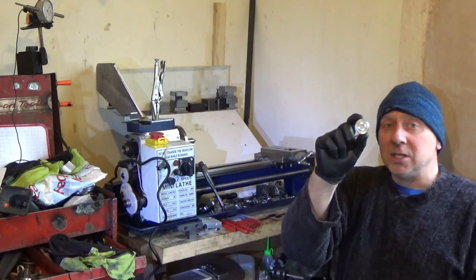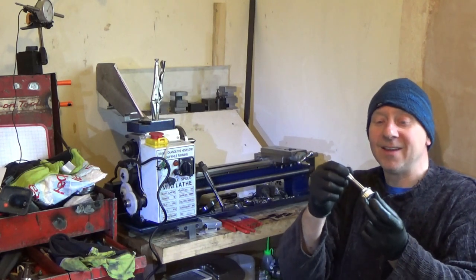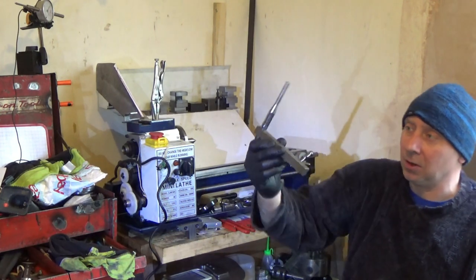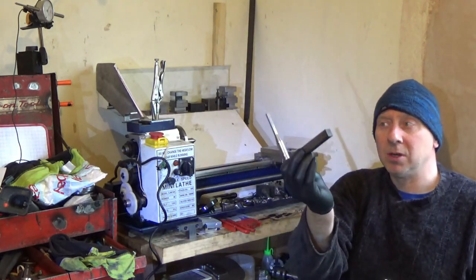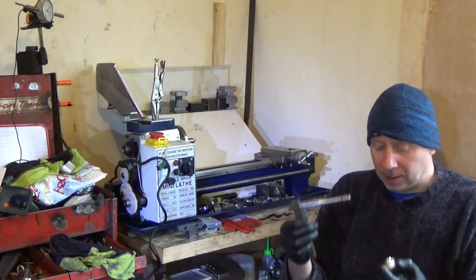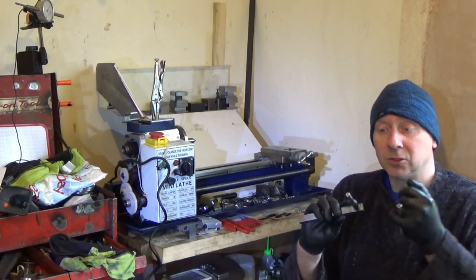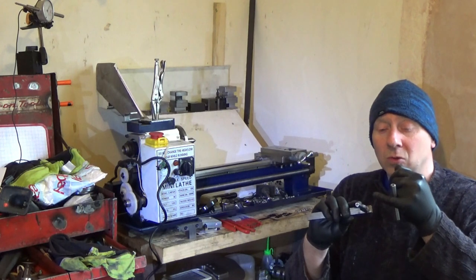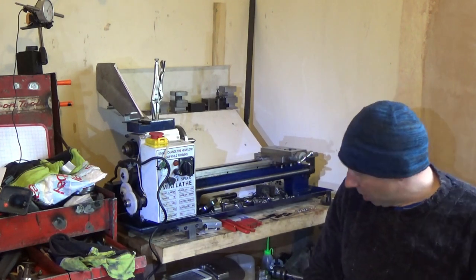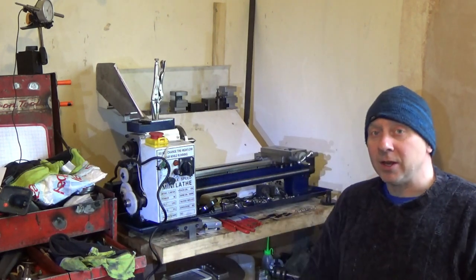So these need keyways in them as well. That don't fit. So this is the arbor or tool holder that came with the shaper. I've made one which goes in there as well. These need drilling, broaching, and they've already got the threads in the end, so I just need cross drilling, broaching, or using round high speed steel, and then they'll be going up and running. Then I can put the three phase on it and it can run at full power.